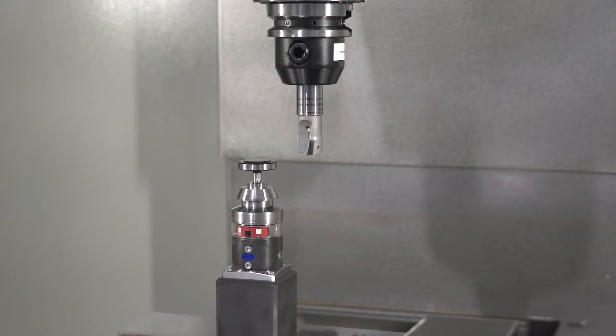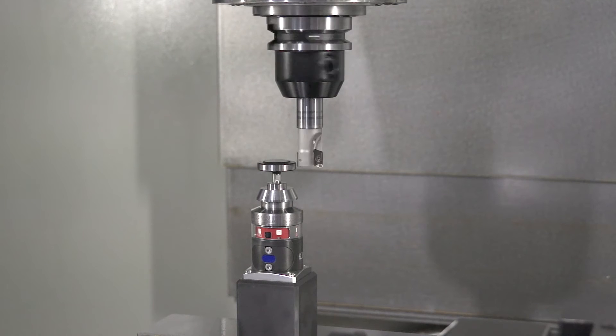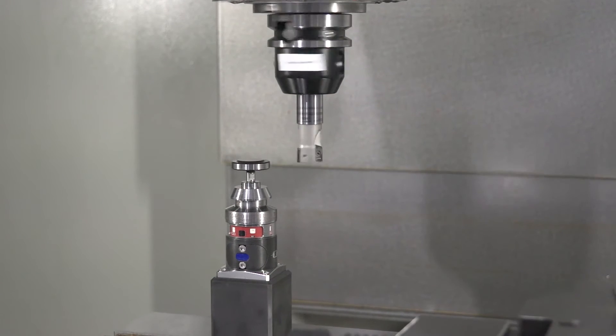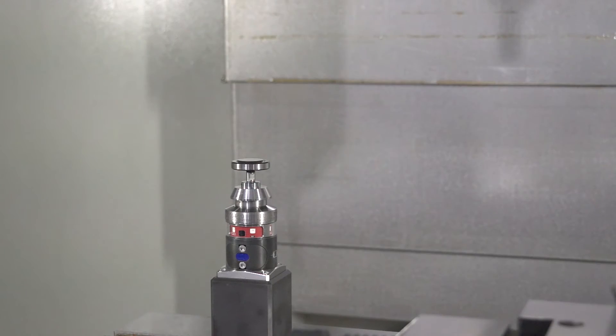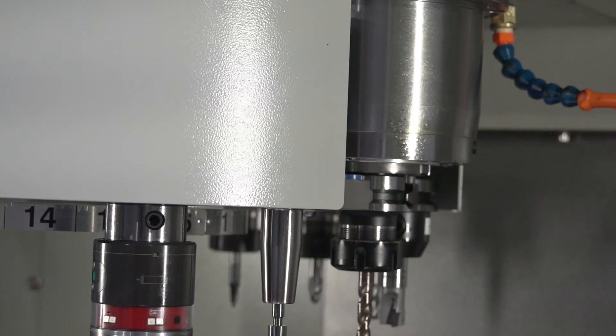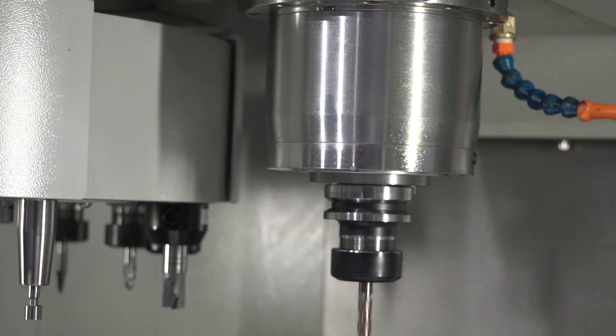David, we're about to see a 3D tool setting probe. What is it and what does it do? It's a mechanical touch probe for setting of tools, which we call the TC5420. The idea is that you can measure and set your tool lengths and radius on the machine, in the machine process, and that's automatically uploaded to the tool offset files ready to use within the cutting program.